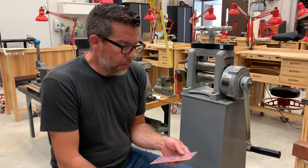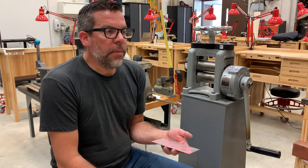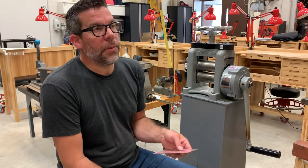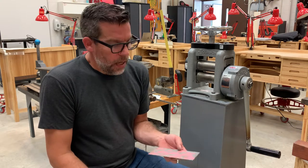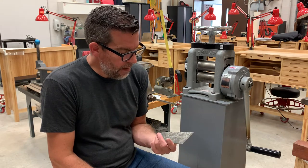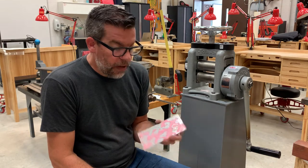One of you asked about using a rolling mill and making an edge plate with a roll, or making an edge plate and then using that in conjunction with a rolling mill to create pattern plates. I've got a piece of steel — in this case it's actually stainless steel — that I have etched using a vinyl resist.